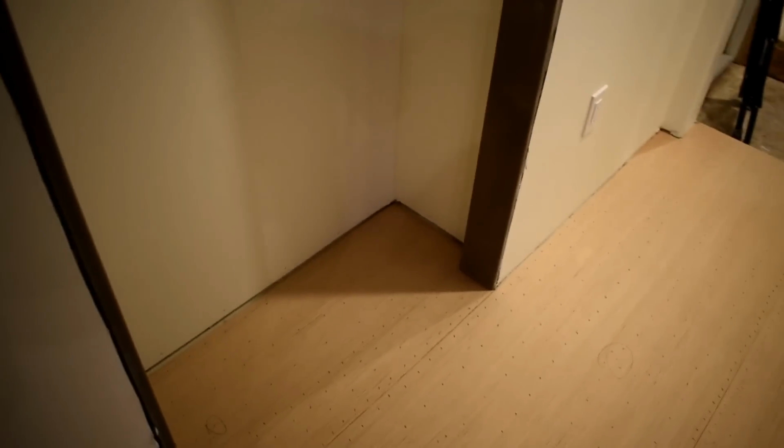I do have some places in the doorways, such as right here, let me see. I will fill stuff like that with floor patch. It's not real bad, maybe a dime will fit in there, but anyway, I want everything perfect. So I will fill that with floor patch as soon as we get here in the morning.